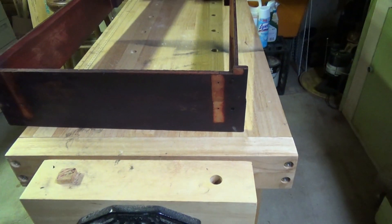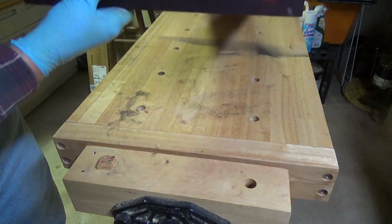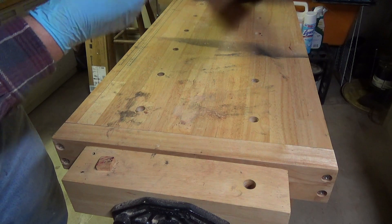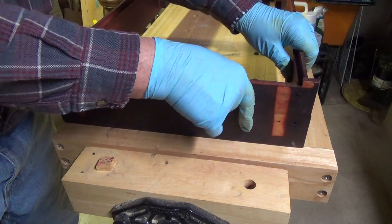It is a Gilbert. What we're going to do is take that back off, because the bottom pieces — or top pieces — are kind of loose. I just need to take this apart, re-glue, put new nails in or re-nail and re-glue it so that it's at least tight. We can clean it up at that point too. The bottom plate on this is cracked into two pieces — there are two pieces originally. We'll take these off and glue these two back together. They are loose.